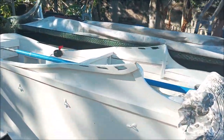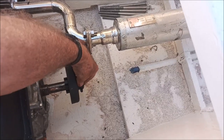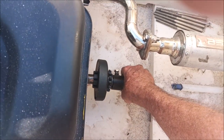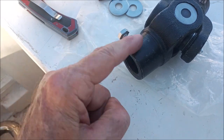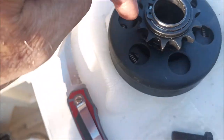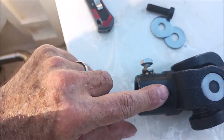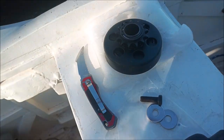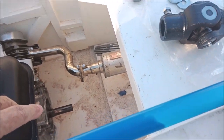So anyway, the other thing we're doing here, we got the clutch. This is a typical clutch, and it slides on here like this. And then we put this one on here, and we're welding fingers onto this one. We're welding fingers that stick out all the way around, and those fingers go into the teeth on the bicycle chain or whatever go-kart chain gears. So the fingers will go all in here. Every one of these is going to have a stainless steel finger that slides in, and they'll be welded here, so they'll stick out this way like this, and that'll just slide onto here and slide off. So it's not mechanically attached at all, other than just a slide-on thing. We're doing that this evening at 7, and hopefully we got the formula to make that work.